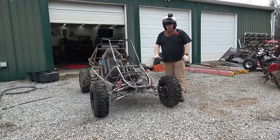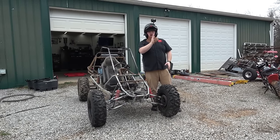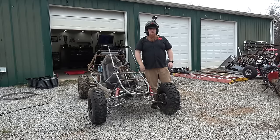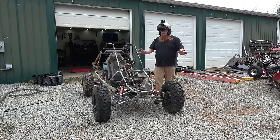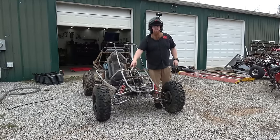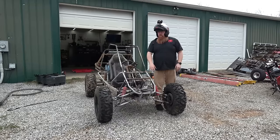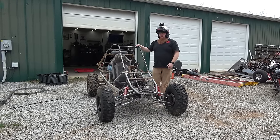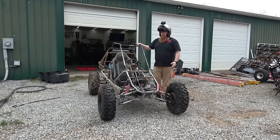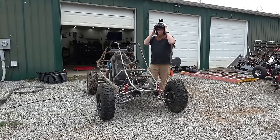All right, so everything's done. We got a little bit of camber to this wheel. We need to adjust the top heim joint in, probably like a turn or so, but it's fine for now. Everything looks good. We set the preload on the shocks all the way down. We had them all the way up and it was way too stiff. So it's gonna be a stiffer front end, but I think it'll be perfect for me because they don't have a lot of travel anyway. So first ride, Lonnie's on the bike to follow me. We'll see what she feels like.